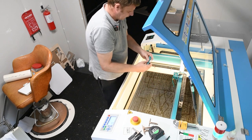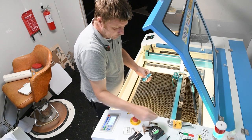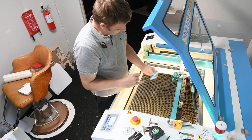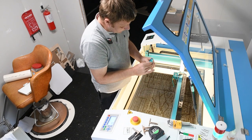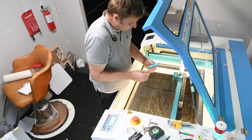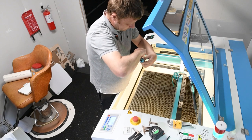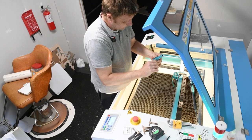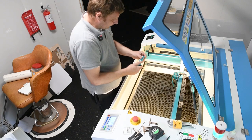Take the laser head out - you can see it needs cleaning as well. In your toolkit you should have these Allen wrenches; if not, it's a six-millimeter Allen wrench. If you use auto focus you want to make a mark where it was so you can put it back. I have a mark on mine from last time, so just keep that in mind. Give it a little half-twist and either drop it right down or take it off - I'll just drop it down and tighten it back up. I'm going to clean this lens.